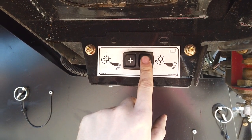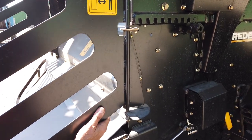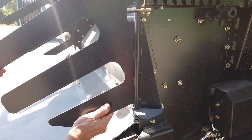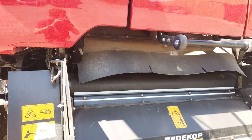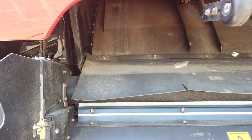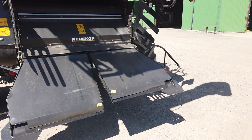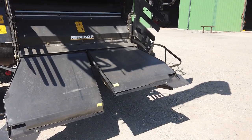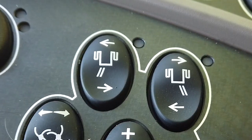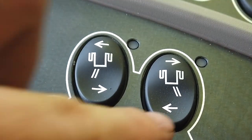Raise the chute completely for roading. The swathe fingers can be lifted, turned and lowered into various positions to widen or narrow the swathe accordingly. When chopping, the door is closed and all residue falls into the chopper. The residue is then spread equally across the crop cut width. Raising or lowering the spread boards can adjust the throw. Individual use of the spread boards can take account of any crosswinds, using the control arm switches in conjunction with the Pro 700 controls.